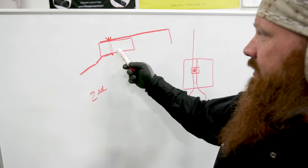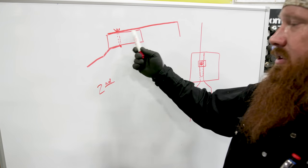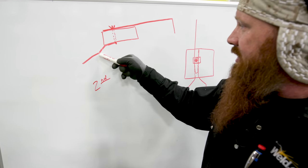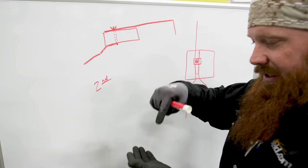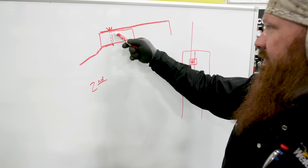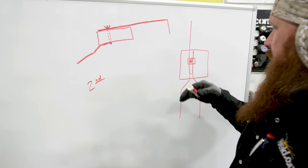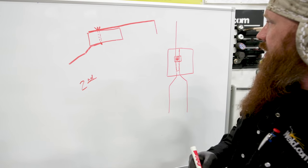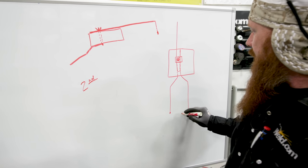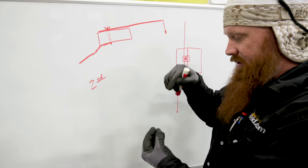This is the second third hand. This piece right here is going to have all the weight distribution. This is going to be a four-by-four-by-inch-and-a-quarter steel block — you've probably seen us use it in other episodes to hold material up or use it as a shim. Today we're going to sacrifice it to build another third hand. We'll have one arm on top and one set of legs on the bottom. This is actually what's going to hold the material we need held, acting as a third hand — holding something up so we can get a tack or a weld on it. Everything's going to be secured with a little wing nut. We're just going to bend pencil rod so it'll be adjustable — this will telescope in and out, and so will the feet. You can also sharpen your point or put silicon bronze on the tip and the feet, and use this as your work-piece clamp for smaller items or to pinpoint ground contact in tight areas.